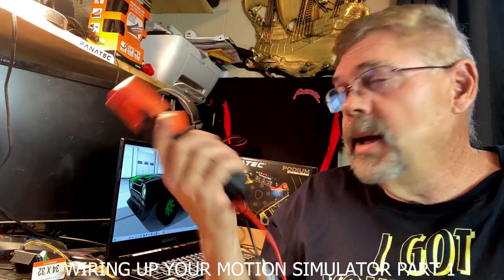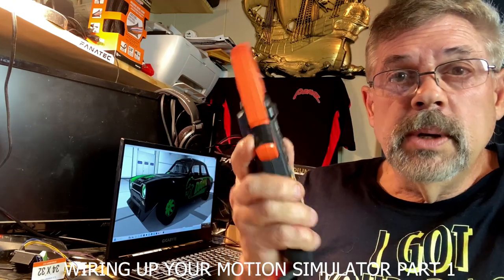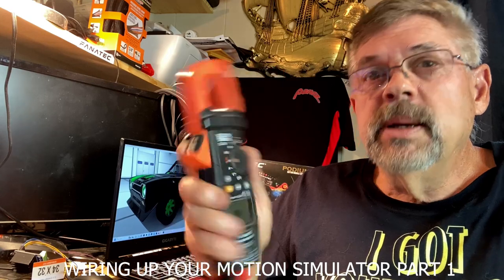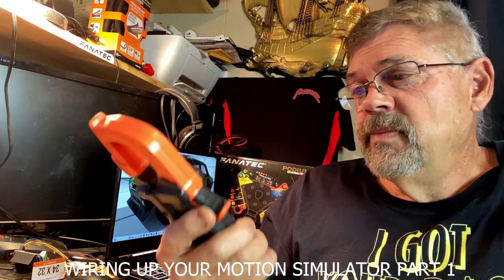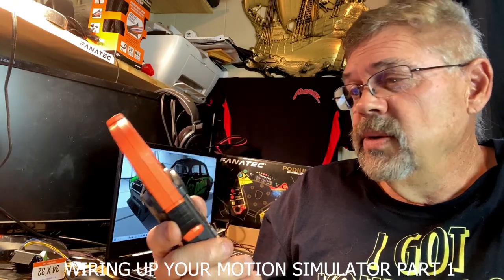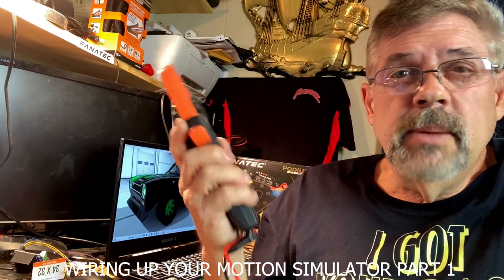If you have problems and you're trying to figure it out, use a magnifying glass to see if any of the components are touching. If you glob solder over everything and they're touching, it's not going to work. So you're going to have to heat it up again and get rid of that solder. You could use a sucker — you press the button and it sucks air, sucking that solder away from your component. But ideally, the thing you want to use to make sure things aren't touching is the multimeter. A cheap one will do — ten bucks well spent.